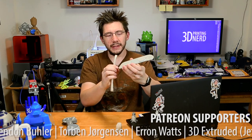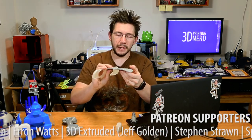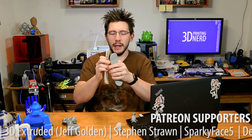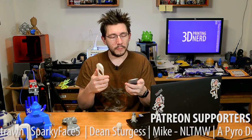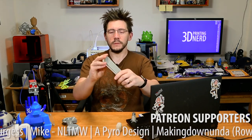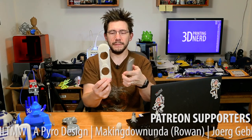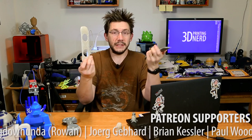One of the things about PVA that you do need to realize is it bonds well to PLA and nylon, and it does a good job. But peel off as much as you can before you drop it in water, because that way there's less for the water to dissolve. It's just like a photo negative or something. It's kind of neat.